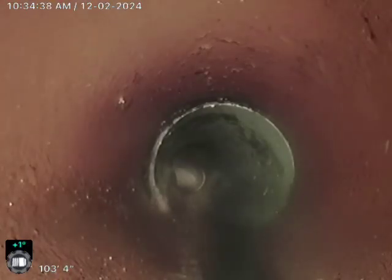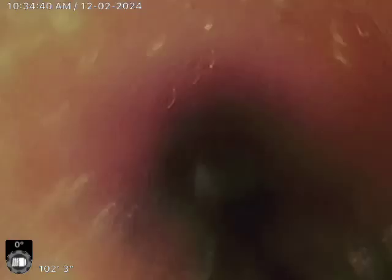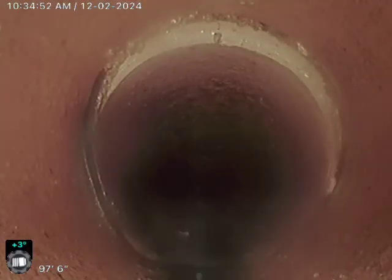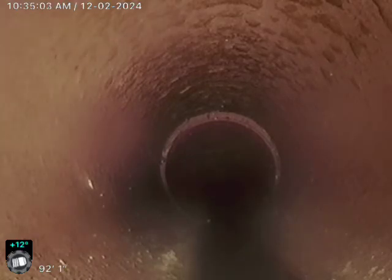Right here we've swapped to clay sewer line. We do have the washer running in the house, so there may be water draining on top of us — out of my control. Slide offset right here, going from the top to the bottom. Everything is water falling over the edge; it's not really impeding any flow. Really not a major concern at all — it's just there. We see that in every clay sewer line. We also expect to see roots. That's another slide offset to the side.